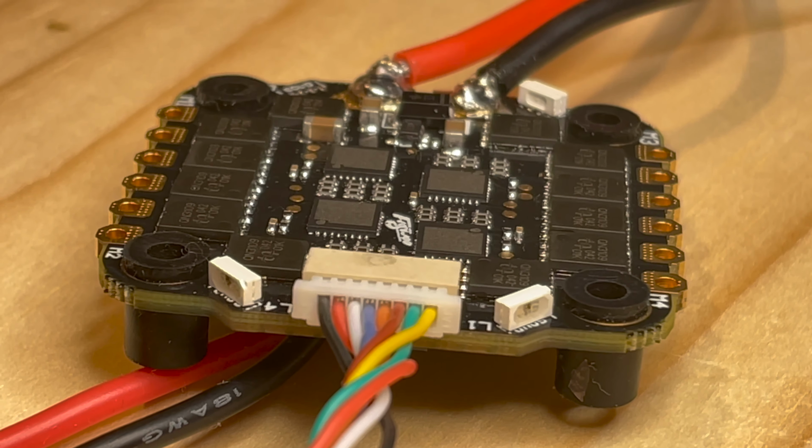So we can see here on the right, the 3 right pins are somehow bent, and that is what we then had to do. Thankfully, the flight controller provides the soldering pads right next to the plug, and that is very helpful here.